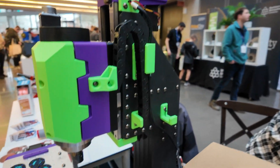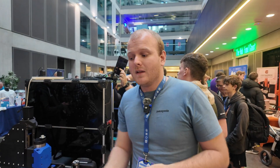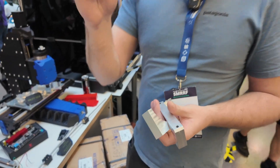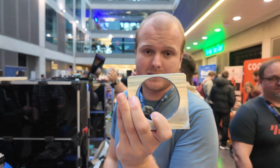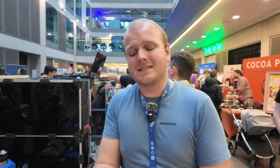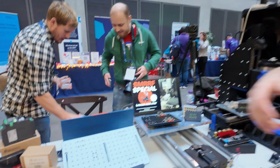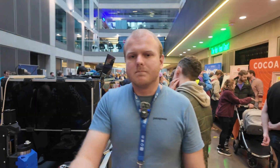Many v1.5 mods — the FMJs, the aluminium spindle mounts — are now integrated as proper features in v2. V2 has four spindle mount options: two 3D-printed for 65mm and 80mm spindles, and two using shrouds to cover custom aluminium mounts. Custom aluminium mounts let us more precisely position the spindle center, whereas off-the-shelf mounts vary in thickness and can't guarantee the full workspace area.